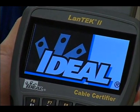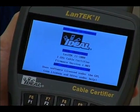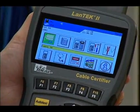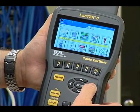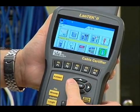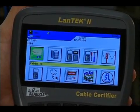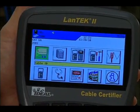The first screen shows the firmware version of the tester as it powers up and performs a self-test. The display handset interface is similar to a typical cell phone in that its functions are pictured as icons, and you navigate using the keypad and navigation keys. The ready screen contains icons for the primary functions, with battery power percentage, number of tests stored, audio settings, date and time, and the current screen name always visible across the top.